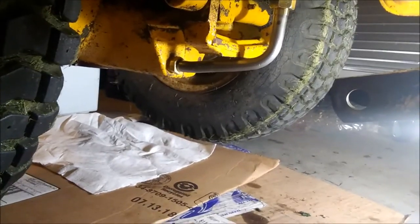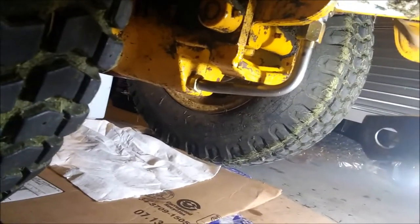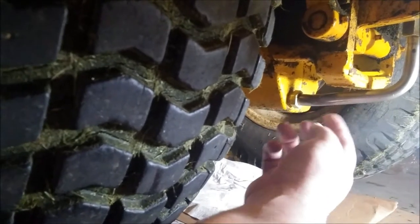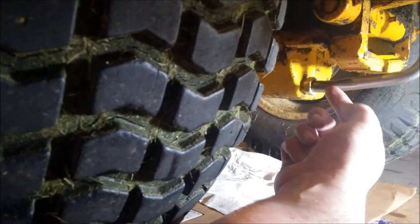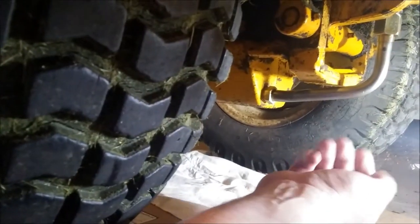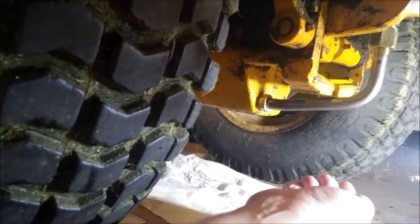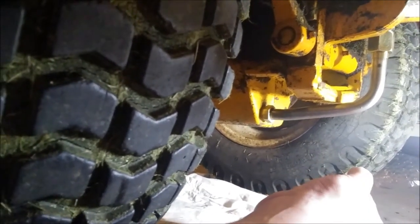So there's our setup. I've got a nice clean sheet of cardboard under it, a clean paper towel sitting on top of that. The tube's tightened up and I'm sure I put enough oil in it to get up past the bottom of this fitting. So if we come back tomorrow and this is dripping, I'll know the compression fitting is leaking. If it isn't, I'll put a little more in, make sure this is completely submerged, get some head pressure on it, and see if it leaks then — slowly filling it in a couple batches as I do other things to the tractor. I'm really gun shy about this thing not leaking because I've had bad luck with it.